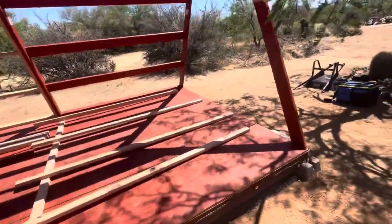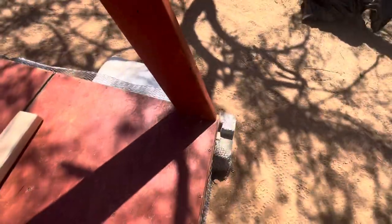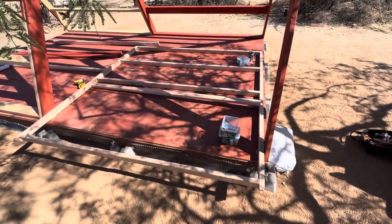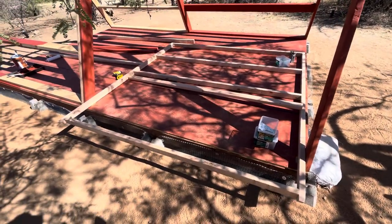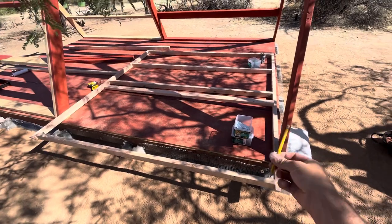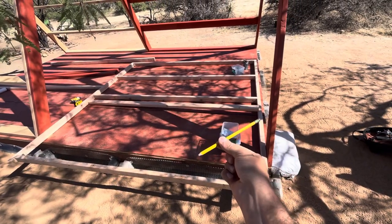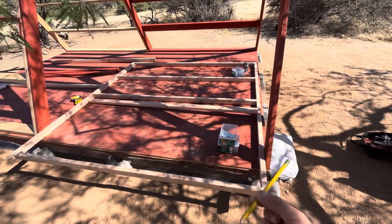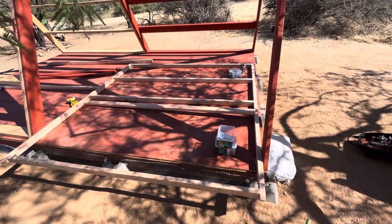First step on the swing door — I just want to match this bevel, 25-degree angle at the bottom. Swing wall is coming along. Gotta make sure that I square it before I do the little 45-degree angle pieces, because if I make it when it's not square, I think it's gonna be real jacked up.